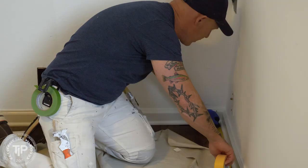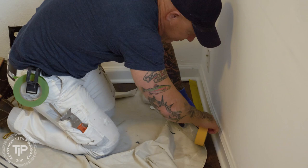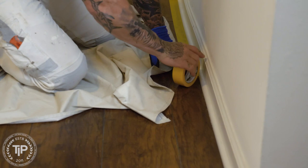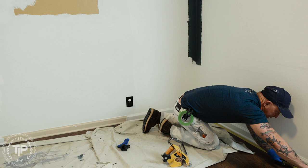I'm going to start masking here on this flooring. I'm going to get my tape tucked up underneath this flooring the best I can, right up against my trim as tight as I can. I also like using an inch and a half tape because I'm going to put paper over the top of this so I don't get any drips onto my wood floor.